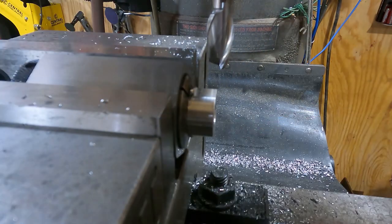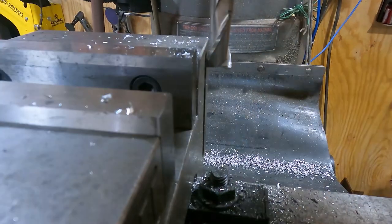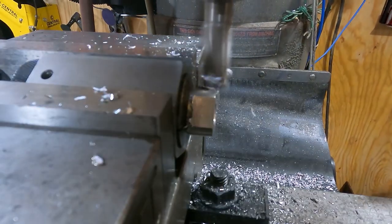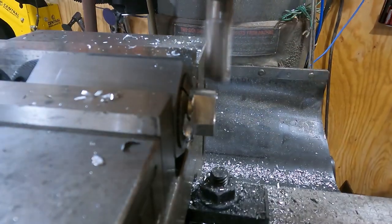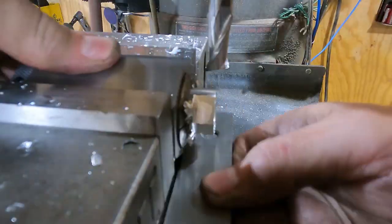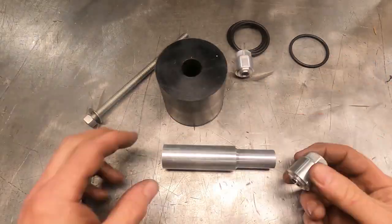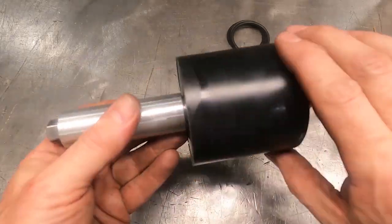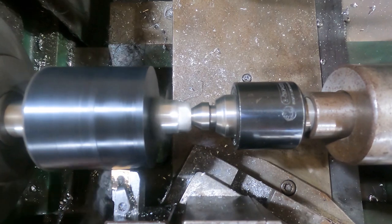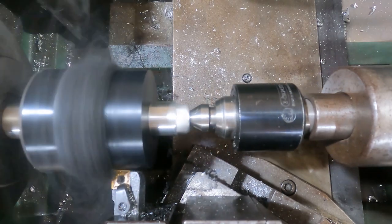We begin final dimension cuts, getting down to the three-quarter inch sides, rotating per side. The two-flute end mill, nice and sharp, does a good job in aluminum — we get a nice shiny finish. We've got an excellent quality three-quarter inch nut. We assemble the plastic onto the mandrel for turning down to diameter on the lathe. The nuts came out nice and smooth, unlike the rough ones shown earlier. There was some lathe work to polish them up, but unfortunately I lost that footage.